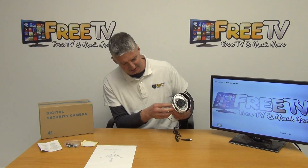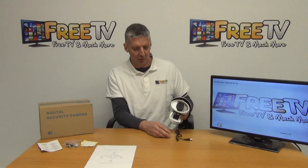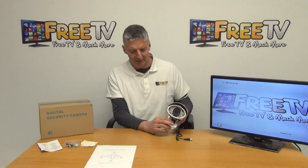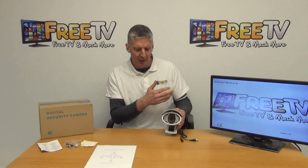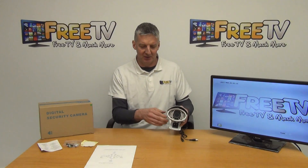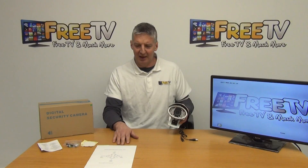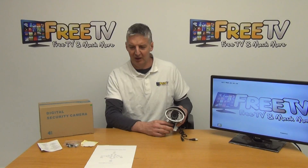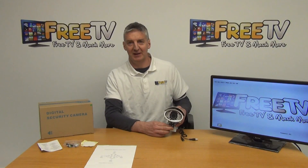I've loosened off some of the screws with the Allen key provided. If we want to bring up the on-screen menu, we connect it to our meter or directly to the DVR and press the button to bring up the menu, where you can balance the colour and other settings. You can scroll through using the buttons, and for toggling the technology: right is AHD, left is analogue, straight down is TVI, and straight up is CVI. Press and hold for 5 seconds to change the settings.